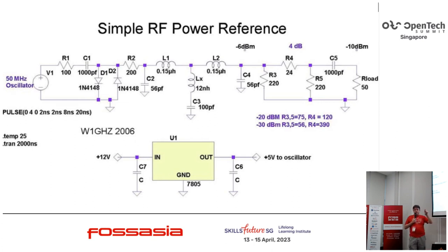Silicon diodes don't tend to change their cutoff voltages over a period of decades. So if the other components don't change, the silicon diodes aren't going anywhere. There might be a thermal problem. I haven't looked carefully at the thermal characteristics, but there are other components that are pretty cheap and fairly stable.